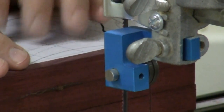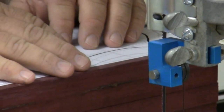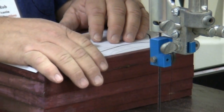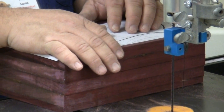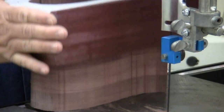I was able to control really nice. And what blade is that? That's an 8. It's a 3/16. The big thing about that Carter is the ability for the saw blade itself to flex. You know, in a regular situation where you've got the guides on either side, your blade is held so it goes straight. With that Carter, it's made with that groove in the roller, so that the blade will actually flex to go with the flow of where you are.